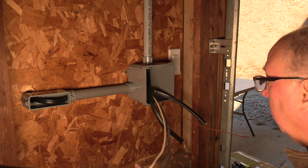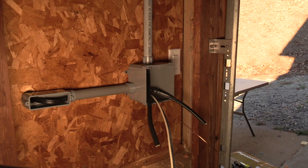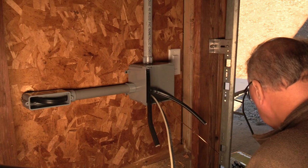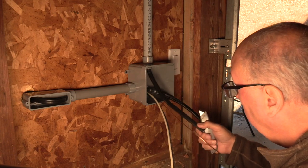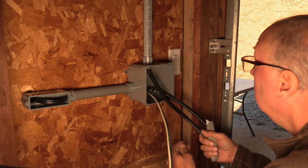It is time to prep the wires inside. One last time — this is the supply line coming from the circuit breaker. I'll confirm the circuit breaker is off. I am the only one here, but if you ever work on something like this and shut off a circuit breaker, close the door on the panel and put a big note that says 'do not enter.' The reason: you don't want somebody in the family to come by, see it open, and flip it back on. You'll not like that.